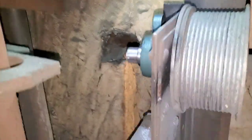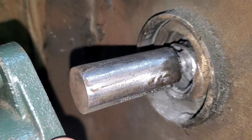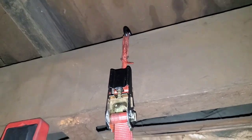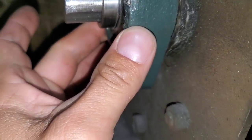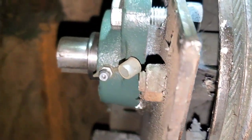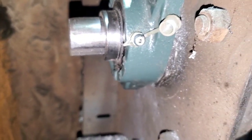All right, I want to go through this real quick. If you run into a pinch on a commercial door or any door — look at what's going on here. This thing is roached, just roached. Let's get these bearings. The way you do it is use some leverage. This is actually holding it up right now — see how it's wobbling around? Then you've got to put these bolts through the little hole; it's going to hold the weight. I got that bolted in there. Like I said, it's a temporary fix. I've got it bolted — that's not the best because there is clearance in there, but it's better than what they had.